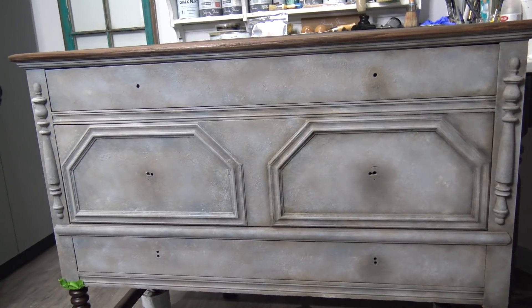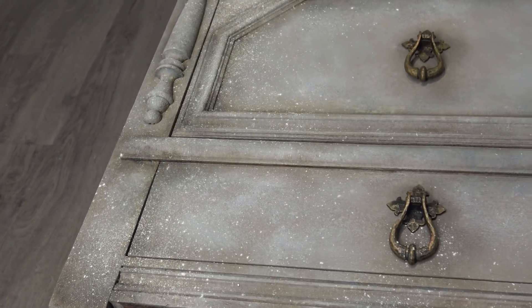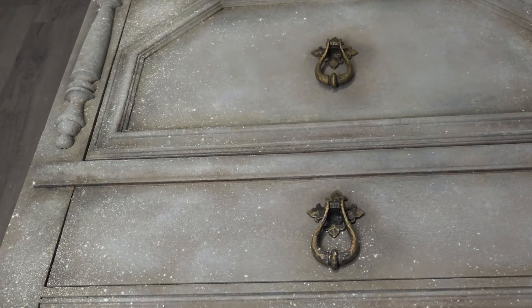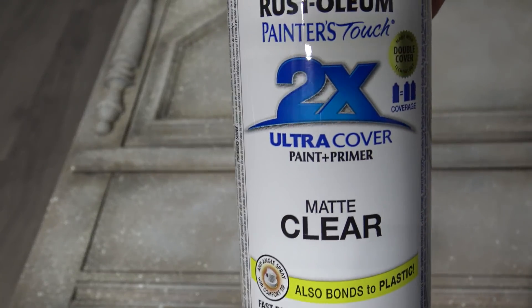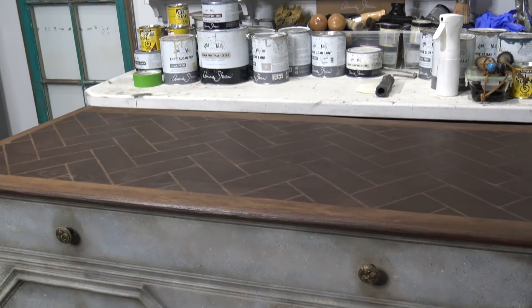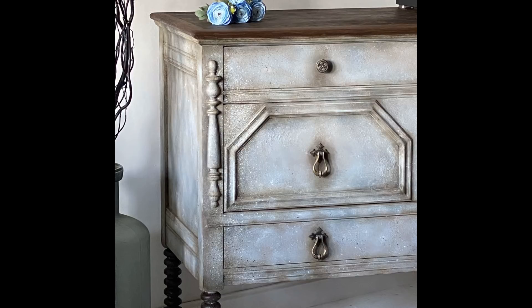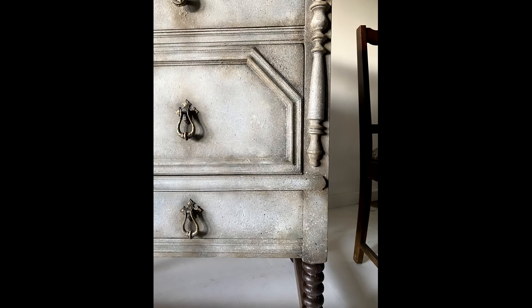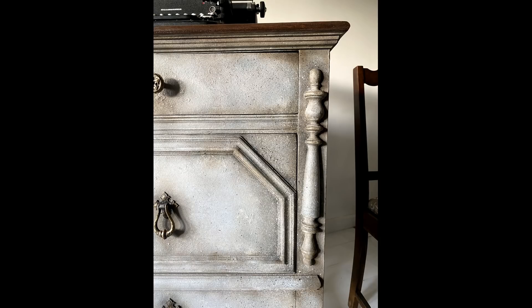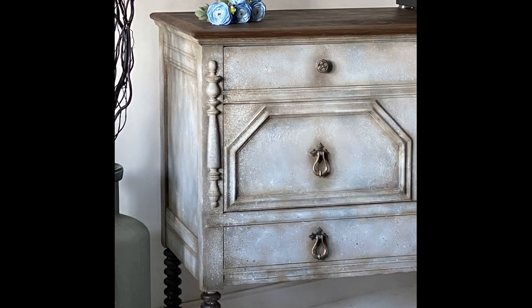Here's a quick shot with and without the waxing. For this last optional step — I absolutely love it — I'm using fresco. I flip the piece onto its back, sprinkle it around, adding more highlights on top of the lowlights I've already created, further enriching that organic aged appearance. To seal the fresco I'm applying a clear matte finish by Rustoleum. Make sure you have good ventilation. All supplies used for this project are available in the description box below — feel free to leave a comment, and I'm looking forward to sharing another chalk paint decorative finish with you next Saturday. Don't forget to subscribe and share!